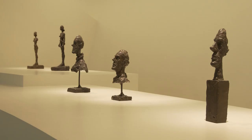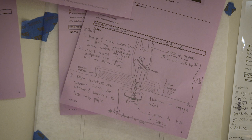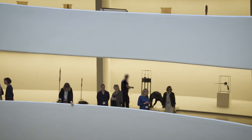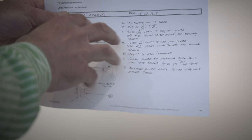Every object you're dealing with has its own unique things. For some of the works, we had to make internal brackets so that it can all be hidden inside. That allows us to actually bolt it down and secure it without seeing anything on the outside. It kind of curls in — there's a lip right at the bottom. In this case, this piece is removable. Looking down on it, it connects into four points, and it's pressure fit in there.